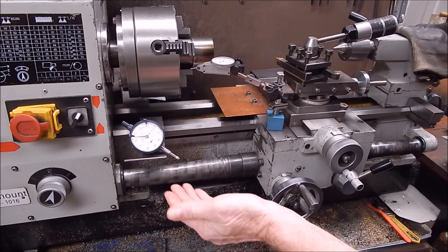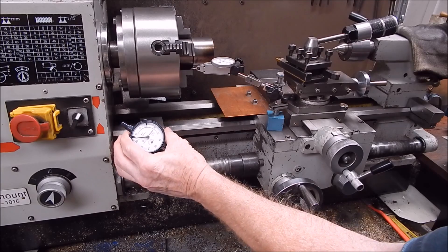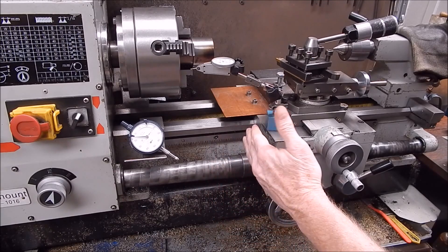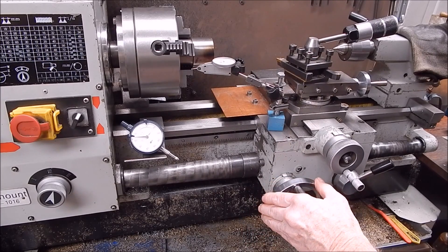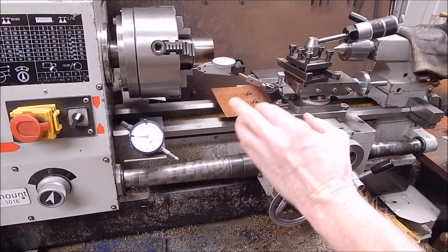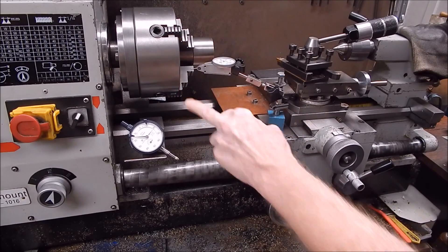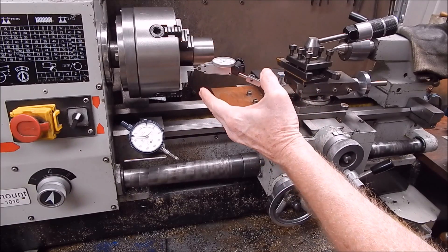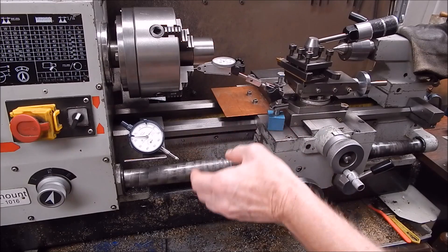At the time I mentioned that if you can afford it — and you should be able to if you buy the cheap stuff — get one of each. Because normal dial indicators are what you'd use for measuring absolute measurements like travel, you know, carriage travel and things like that. A few people got back to me saying you should use both, and there's a place for both. But that wasn't what the video was about — it was really about trying to get through to newbies: don't be afraid of a dial test indicator because it looks like some high-tech bit of wizardry. It is very simple to use and it's perfect for four-jaw work.